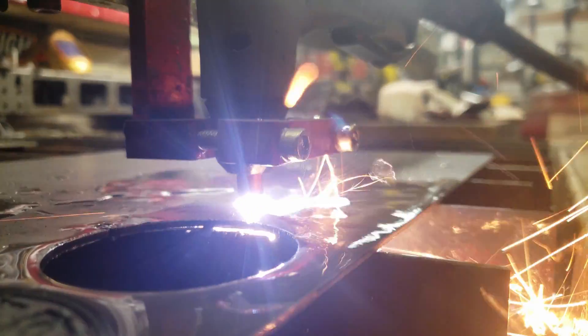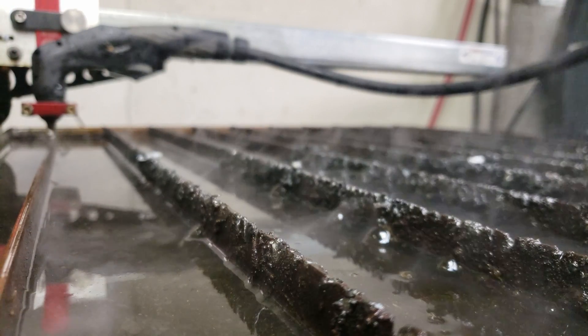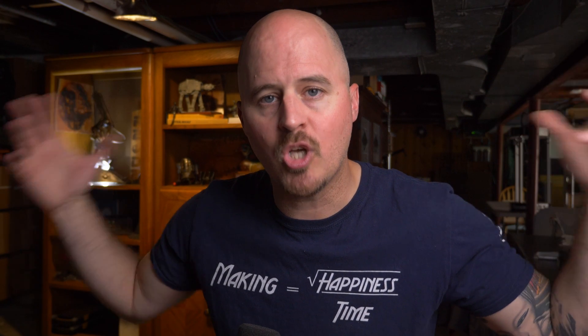You also have to understand that when the plasma cutter is heating up the water, it turns it into vapor. The water table is dissipating a lot of heat, the water temperature will increase, and it will produce steam. I've run this table for a couple of hours one day getting ready for a show and my shop was just a jungle. If you don't wear a respirator, it will impact you negatively — you'll feel it, taste it, it'll be in your lungs, it will make you short of breath. In a very small shop, you need to open all the doors and windows and get lots of airflow. My compressor was also sucking in all this really moist air, which totally used up my desiccant. Dealing with the water table in a small enclosed environment was not something I was prepared for.